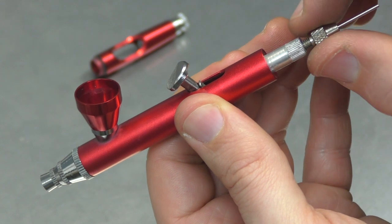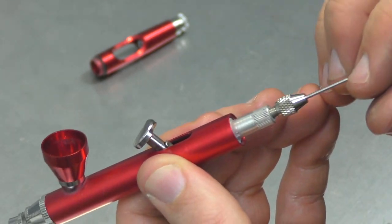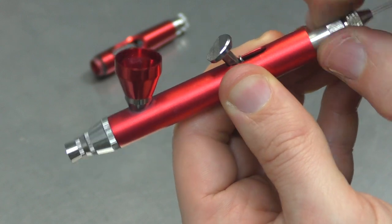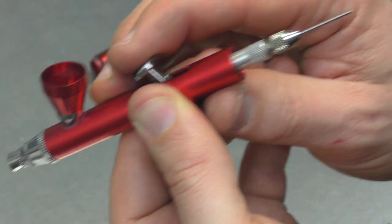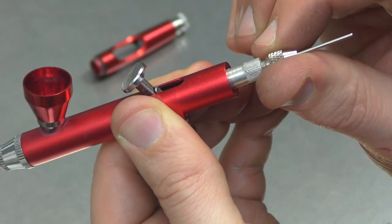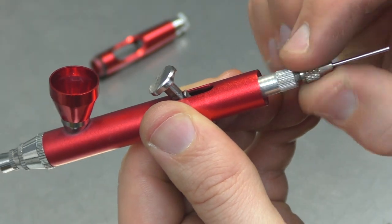So reinsert the needle. So the locking nut — screw it on. Push the needle in until it seats. Don't jam it, don't force it too hard because you could split the fluid nozzle — you don't want to do that, split or flare it. And then tighten this up. To make sure that it's all correctly put together, pull back on the needle and make sure the needle is moving when you pull back. If it's not, then you'll fill this all up with paint and you'll pull back and nothing will happen, because that needle needs to move back and forth to allow that paint to come through.